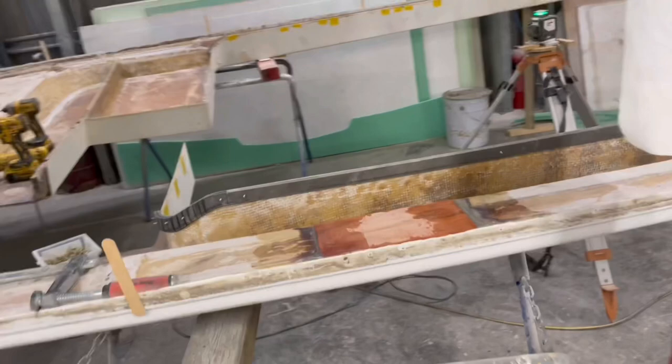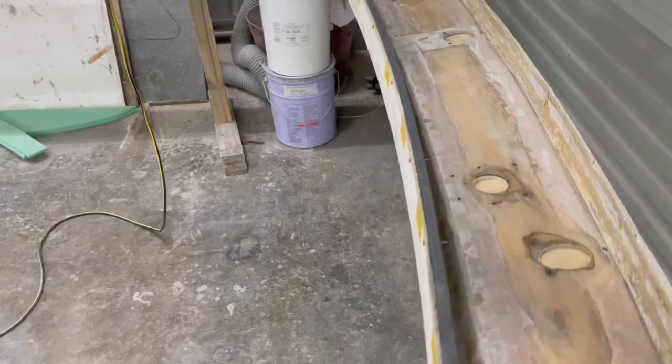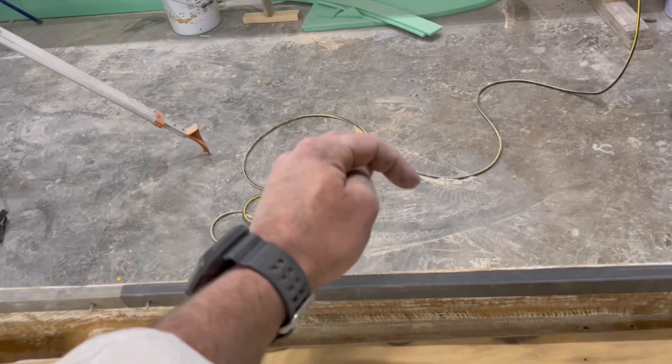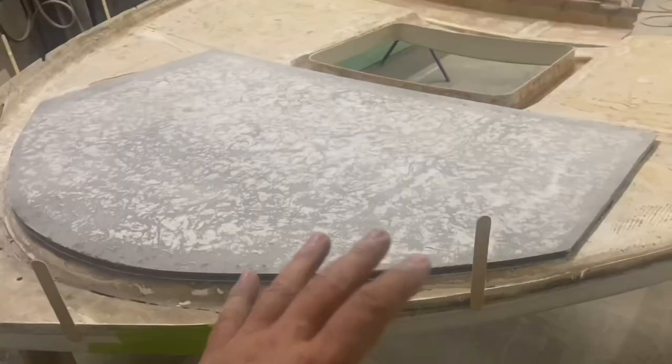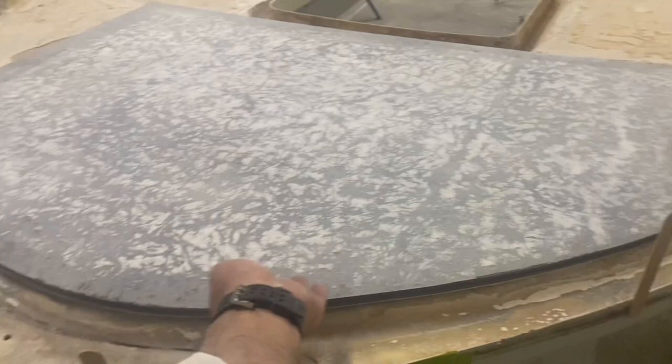So this is what I've been doing — I've been doing this lip here. And to get the corners, I just do a lot of relief cuts, and then I'll use epoxy resin to glue that in. After it's hardened, I'll sand and longboard it so it's flat, and then I'll route that edge and that edge after I've ground this back a lot, because I need to get glass to wrap over like that. So I've got to get this to curve. I don't know how this is going to turn out, but I'm going to try it anyway. I'm going to put a million slits underneath this bit so it can bend that way.